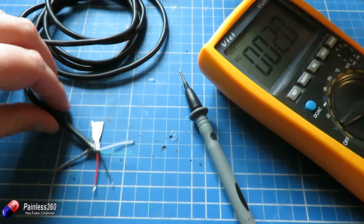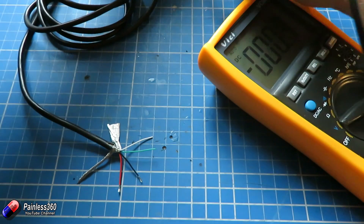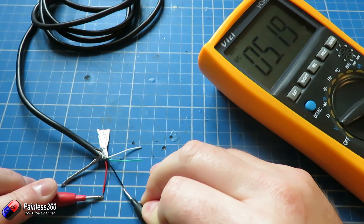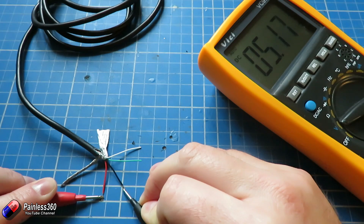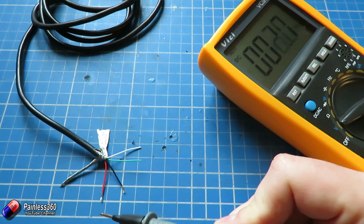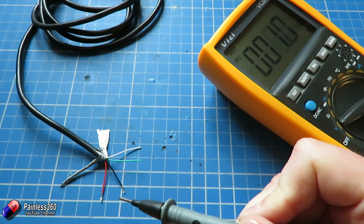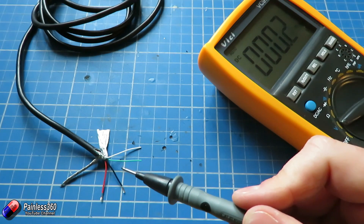The other end of the cable is plugged into the battery power pack. Before I turn it on, double check that you have lots of room between the black and the red wires, because if they're touching that's going to be an electrical short. So let me turn the output on, put the prongs on those leads, and you can see we've got exactly 5.17 volts — perfect for all the 5 volt electronics like servos, receivers, and all the goodness we need in the hobby. Now I'm going to cut the rest off and put servo pins on these two wires and into a servo housing.